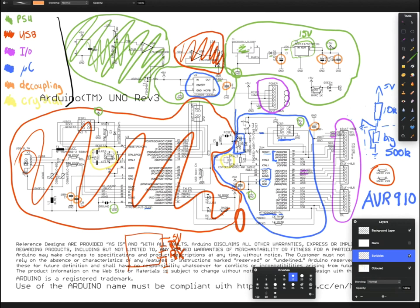And by distributing these all over the circuit, we basically decrease the amount of ripples in the power supply because everyone can store a little bit of energy closer to where they need it. It's really important, and it's unusual to find this for something in a schematic, that these decoupling capacitors, which you see here and here and here and here and so forth, need to be physically and geometrically very close to the thing that they're decoupling. So here, you would want to make these wires as short as physically possible. That's to reduce the resistance between the capacitor and the chip.